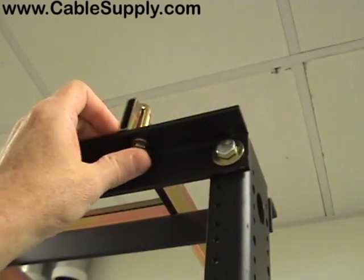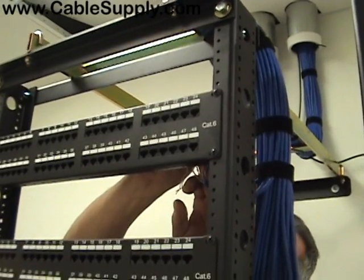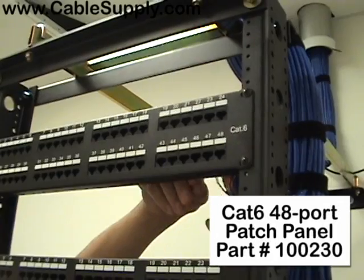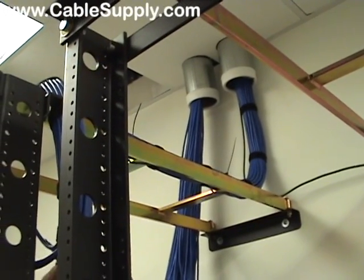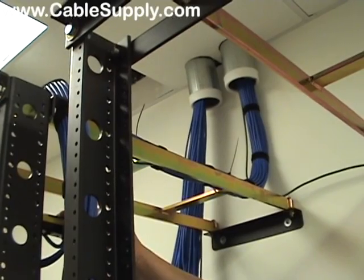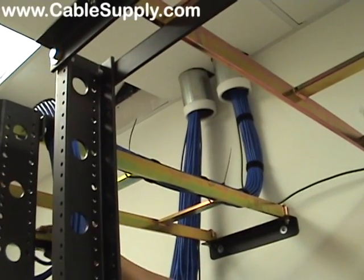Let's take a look at the front. There are your J hooks holding the frame where equipment will be attached — in this case a 48-port patch panel. Notice the nice sleeve with the stub out in the ceiling: the stub out has a little white ring that goes around the four-inch stub out to protect the cables as you pull them through, keeping everything neat.